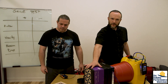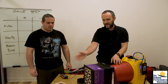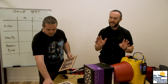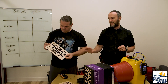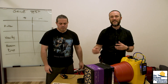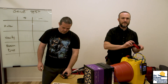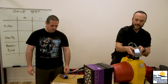We've now converted this box to basically a duct boot, so we're sending the air into this box and it's coming out of the face of it. These grills are from a company I've worked with for a while called Stellar Air Vents — we have them installed here in our house. Please don't let your friends and family buy decorative floor vent covers that don't have test data on them. We've got our imaginary boot here, our grill cover, and we're running the 74 ring on our duct tester, monitoring in inches of water column.